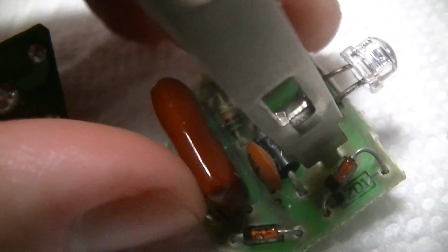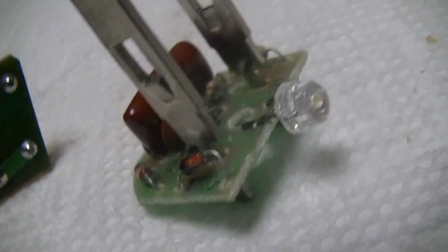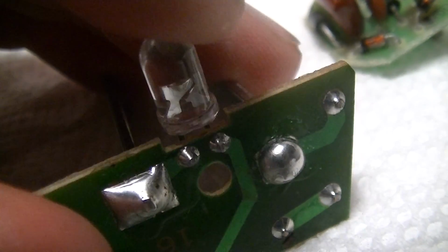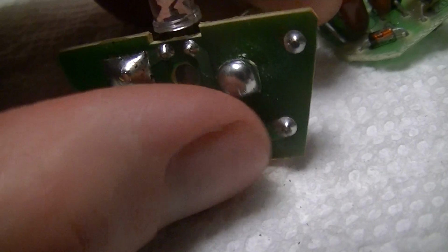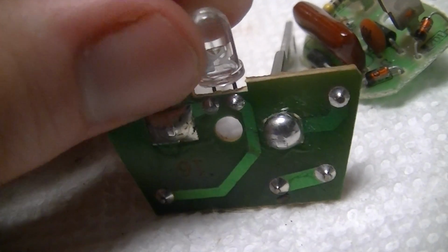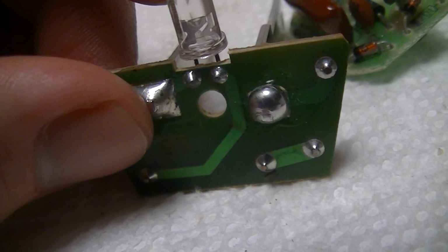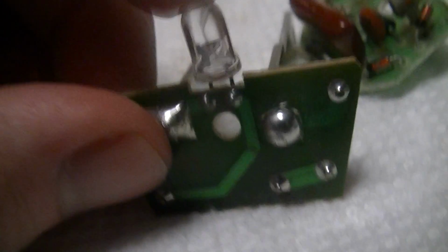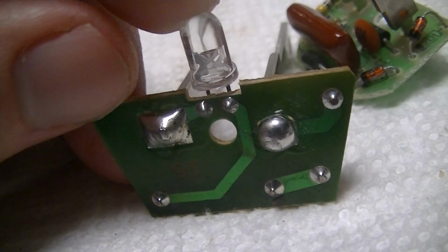But yeah, at least this has some kind of circuitry to prevent that. And of course, with this, it could be very easily alleviated by having just a little single chip Graetz bridge in there. And also it could be improved by having more LEDs in series, because then you could reduce the current substantially. Of course, it would drive up the BOM cost, but considering that the Chinese are stamping these LEDs out by the billions,